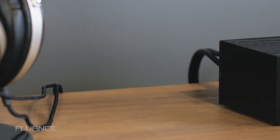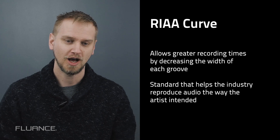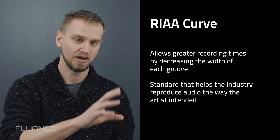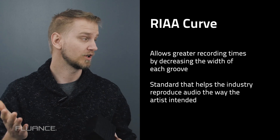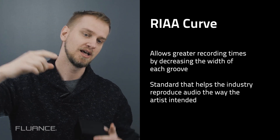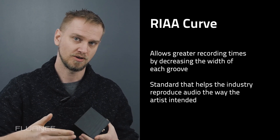The PA-10 applies a RIAA curve to the signal. RIAA is the Recording Industry Association of America. They've created a standard that people on the mixing side or lathe cutting side understand, and on the turntable reproduction and preamp side we understand what reproduction means. The curve scoops away or boosts content in certain frequency areas — scooping low-end or increasing highs — and really what that's for is to reduce the groove size overall that the lathe is cutting into the vinyl, which allows you to put more songs on a vinyl record.